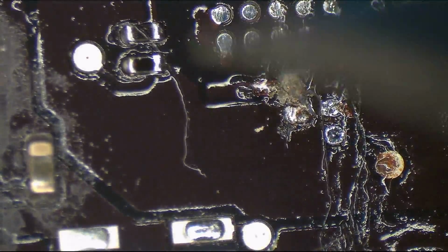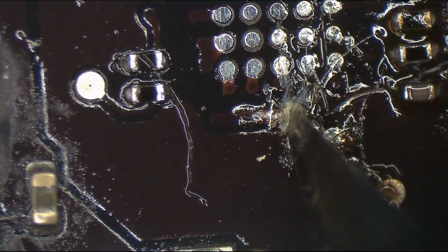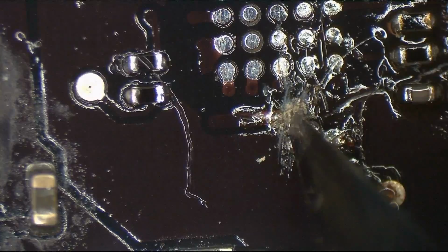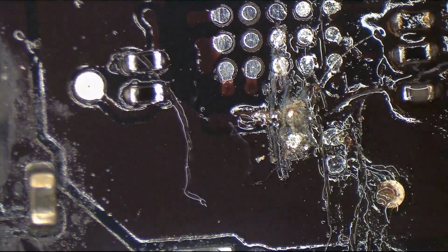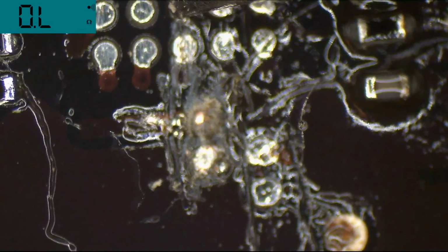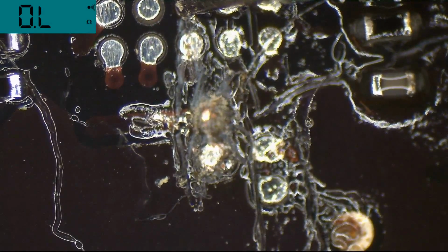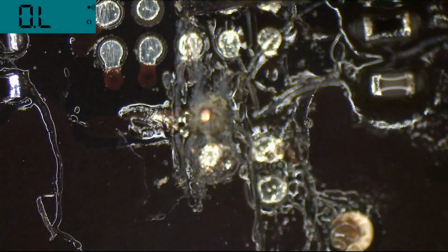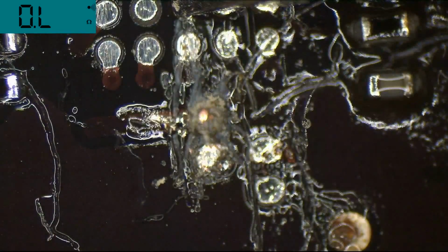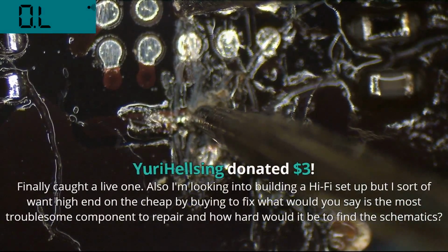Oh, what's this? Whew. Hello. I see something. I see London, I see France, I see PP3V3_S0. Or is that ground? One way to find out. Zoom. Alright, what are you? I found something. Okay, let's put the meter in beeping mode and see if that goes up here where I need it to. Let's see if that's ground. Oh, okay, we found it. So this goes to this. Hear that? That is beautiful.